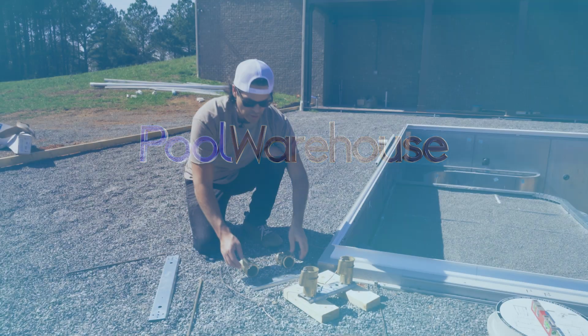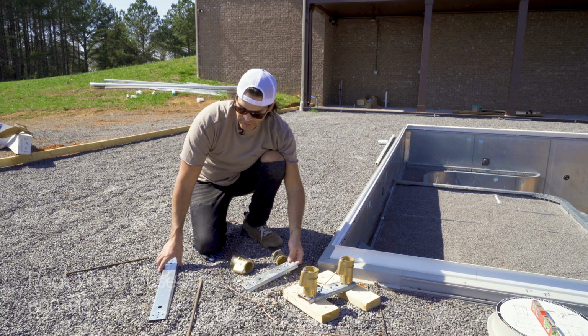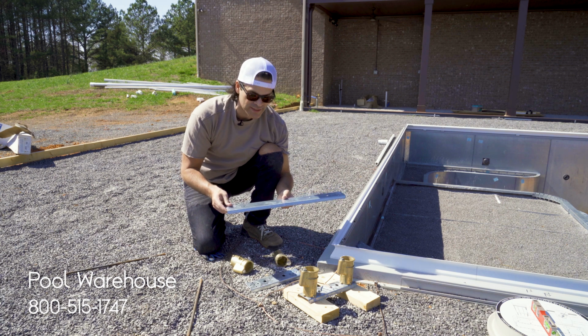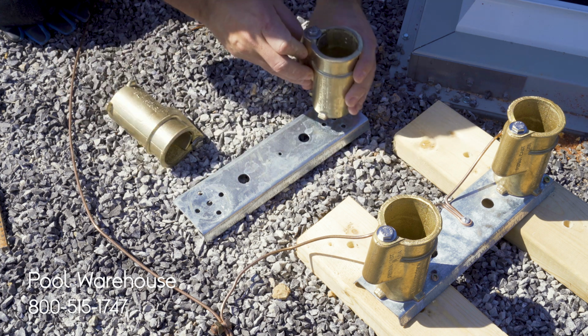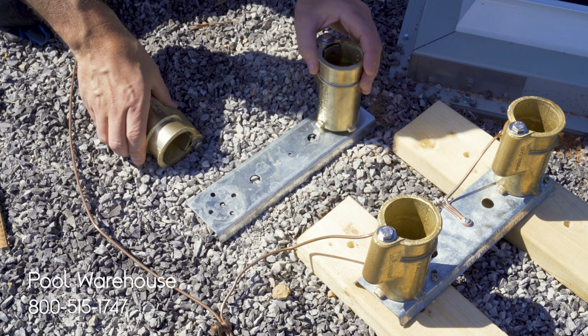Now we've gone ahead and got our channel and our anchors out. You'll get two different channels. You'll have an 8-inch and you have a longer one that's for your ladder. This goes in the deep end, but right now we're sitting by the handrail. Now your anchors will attach directly to the channel, and they're going to screw right into the holes. You can see those right there.